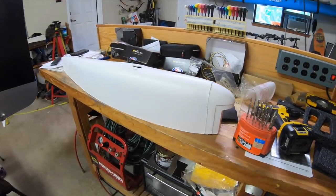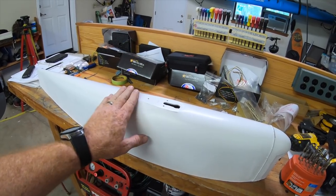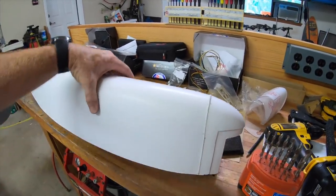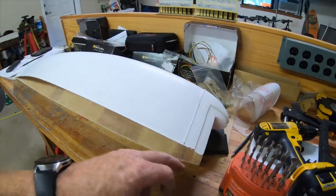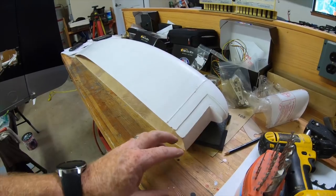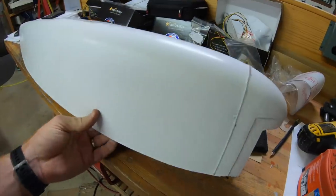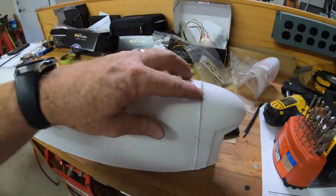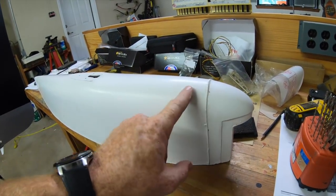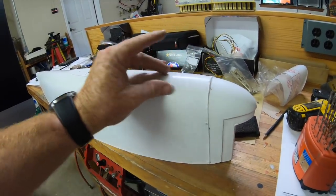I started working on these wingtips. I got the position and strobe light on the wingtip all drilled and ready for the bracket. So I started looking at the craftsmanship on these, and I realized because of this step here the mold has to be made in two pieces - otherwise the mold would get stuck. But this seam is just atrocious - there's a sixteenth to an eighth inch lip all the way around, and the top part doesn't line up with the bottom part at all. There's a big step right here that's going to need a lot of fill work.